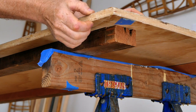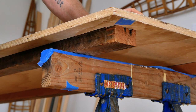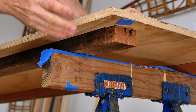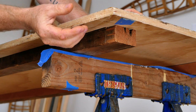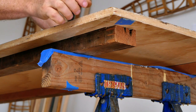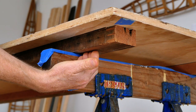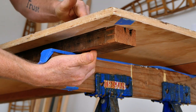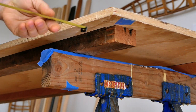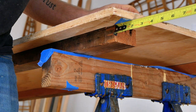I've reinforced the plywood with two construction-grade 2x4s or 2x6s screwed to the bottom. Specifically, this is birch ply, but you could use any high-grade plywood with a lot of layers. I wouldn't spring for the super expensive birch ply — shop grade is just fine. Stay away from lower-grade plywood with fewer layers and rough surfaces, and especially don't use OSB or MDF. The 2x4 or 2x6 is screwed straight through the top of the bench with some sheetrock screws every 8 to 10 inches, positioned 2 inches away from the edge on the side and also on the ends.